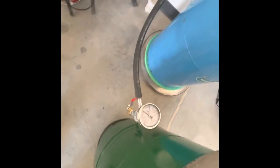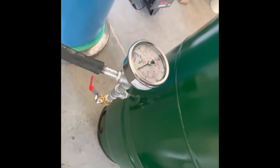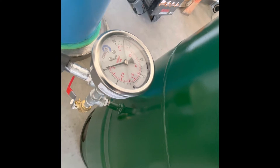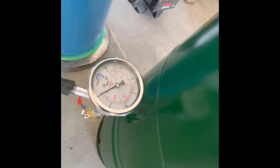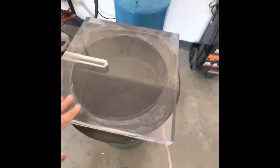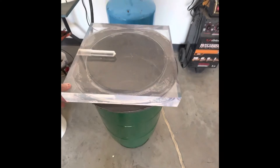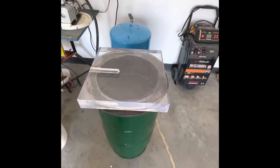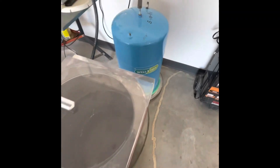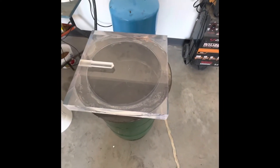Here's the vacuum pump. I welded a stub tube there for the vacuum hose to hook to. I modified this one a bit — that's where I just JB welded it in since it wasn't taking a lot of pressure. The way you do this is you set this acrylic piece on top. It was just too small, so I had to glue a metal ring on there to make it fit and sit on the chamber opening.